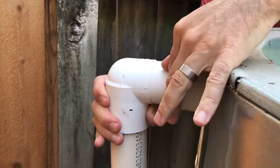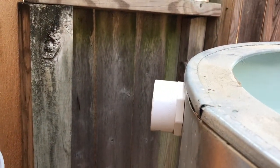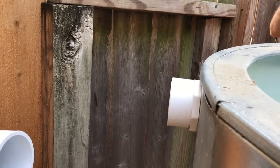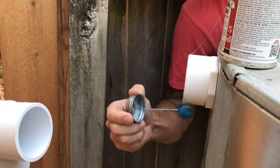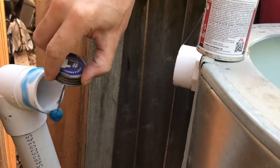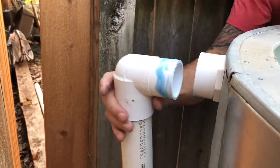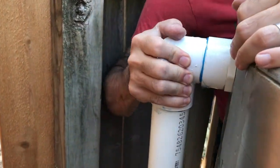If you don't need to move your overflow rainwater that far away from the tank, consider building a little rain garden right at the base of the tank. This is a cool landscape feature and really easy to make. You just form a basin in your ground about two feet deep, usually planted with native plants that don't mind having soggy roots for a while after a heavy rain. It will allow the water to slowly seep into the ground rather than rushing off. Here in Austin we need to do everything we can to keep stormwater on our property.